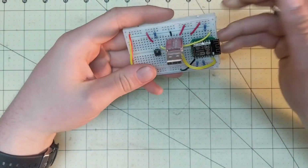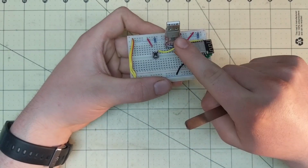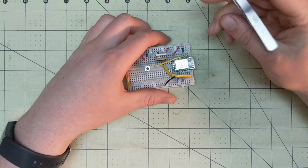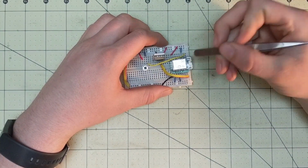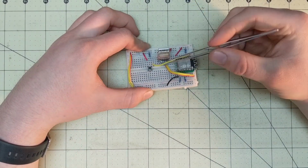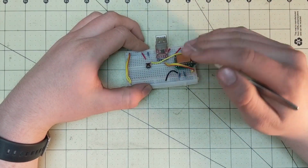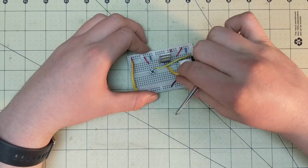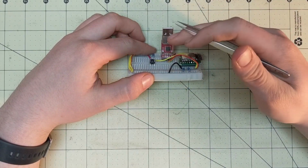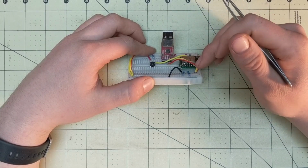So now the chip is hooked up to the ground and positive of this USB, which is 3.3 volts. There's also an option for 5 volts. Now, a lot of people say that 5 volts will kill this chip, but I've tried voltage dividers, just on the transmit of this thing going to the receive of this, and it never seems to work for me. So you may want to be safe and use a voltage divider to lower the 5 volt data coming from this to the chip, and limit it to 3 volts, but it never seems to work for me.